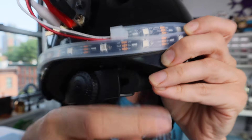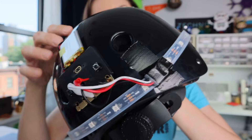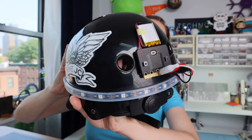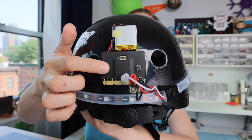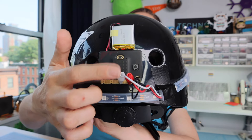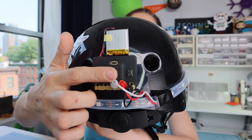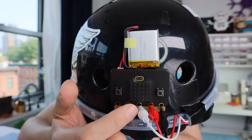There we go. Just to keep this little piece in place, I'm going to use a piece of duct tape because the two overlap slightly. This is the simplest build of the project: we have our battery, our microbit in its case connected to the helmet via velcro, our NeoPixel strip connected to the microbit with the alligator clips it came with, connecting to ground, power, and pin 2.